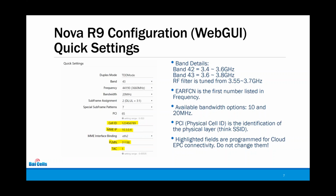3.7. The other note is I mentioned the EARFCN, this is a number, and I'm mentioning it because there's a procedure called PCI lock on the subscribers. When you connect a subscriber to the base station, you can actually lock it to a specific cell, and it requires two parts. It requires the EARFCN, which is that first number by the frequency. LTE uses a different number to determine what the frequency will be, and they call that EARFCN. The other number it will ask for is PCI. PCI stands for physical cell ID. You could think of it as an SSID. It's how the subscriber can identify the base station.